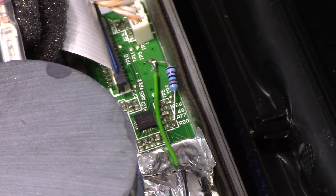Alright, I've disabled the button by installing a 12K pull-down resistor to ground on top of it. It's a bit crude, it isn't really how you disable a button according to the datasheet, but in order to do that you would have to do a fair amount of modifications since they're multiplexed.